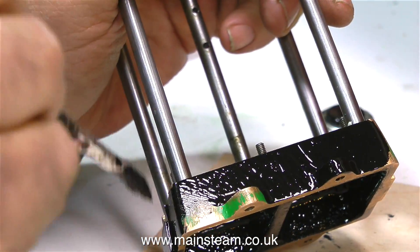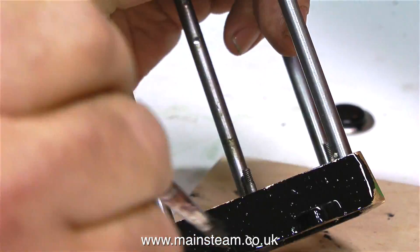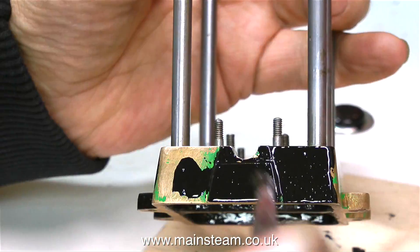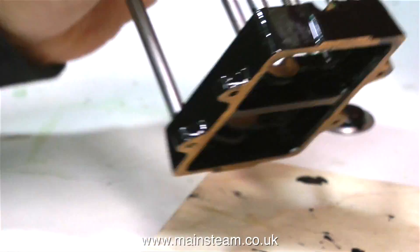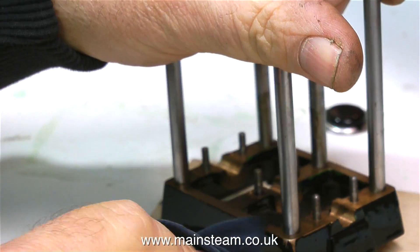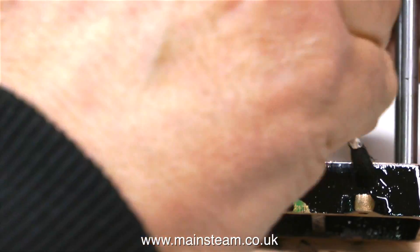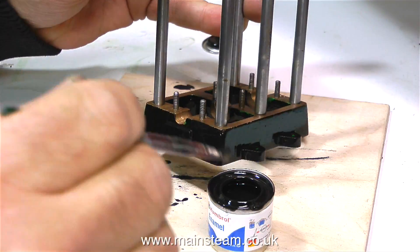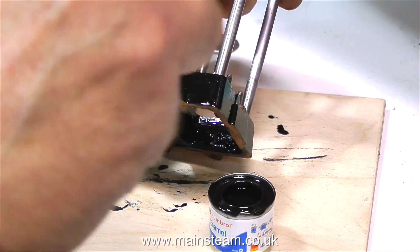If I paint everything black, it's going to look a bit messy. These Stuart Twin Launch engines almost always have the top surface of the gunmetal left unpainted. This video is slightly deceptive at this stage — it looks like I'm really putting too much paint on, but I'm not, because it was very cold in the workshop when I painted this, and it took a while for the paint to thin out on the work itself. I'll reserve judgement until I see it once the paint's dried. That's the first coat of painting done on the bed plate, so I'm going to put it out of the way so it doesn't pick up any dirt and filth off the bench.